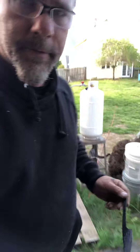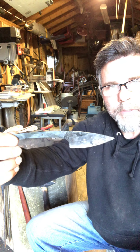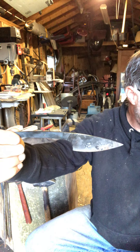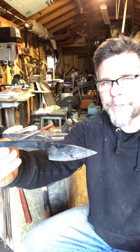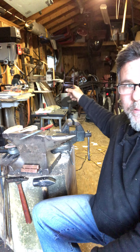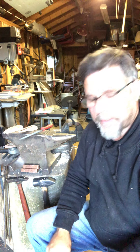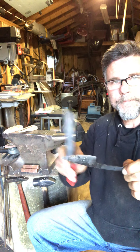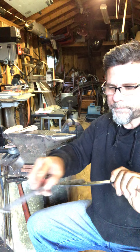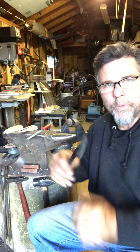It's pretty cool to the touch right now and we gotta do a file check. I've got you on a tripod. It's still a little warm — here's the blade. It was a chunk of metal from a lawnmower blade, so it's hardfacing metal, and I shaped it on my 2x72 belt grinder. We're gonna see what the file does on this — sounds pretty good.